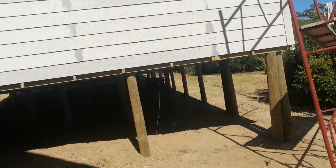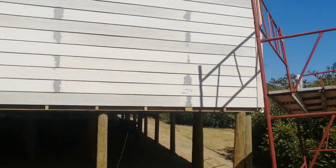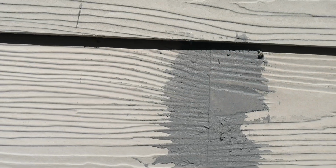These are the joints where the end planks will obviously meet. You will not get a full length because our planks come in 3.6. So the 3.6 finishes or ends there, and then you have offcuts of maybe 600 to 1.2 on these patches that are going up where they're fiber sealed, and also on those ones, those are joints. That's where we are putting the fiber seals to make sure that we give enough waterproofing. So as you can see here, this is the effect of the fiber seal. It is sealed.